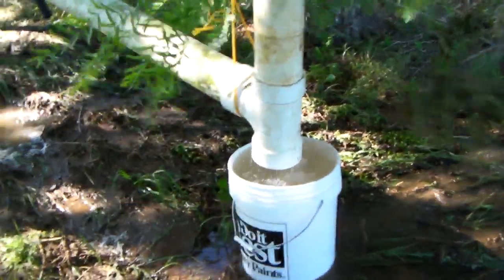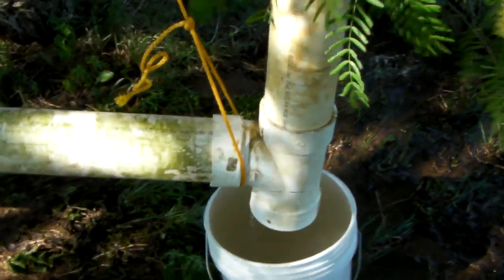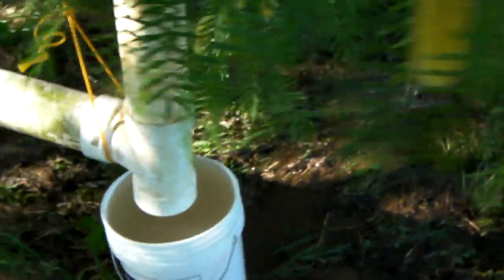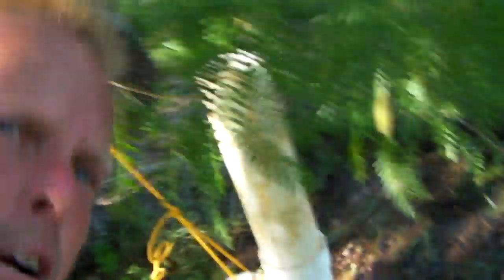We figured our drawdown's probably could be close to 10 feet, so it's going a long way up outside the water, but it's working. If we could fit three in here we would, but there's not much more room left in this casing — this barely fit as it is. That's the newest design I got so far, and I guarantee it'll work better than a two inch. I've gotten a two inch to do 22 and a half to 25 gallons per minute but I'm having to hit it with a lot of air. What we're using to keep this sucker going right now is this compressor over here. So there you go — tandem airlift pump and it works. organicmike.com, subscribe if you like.